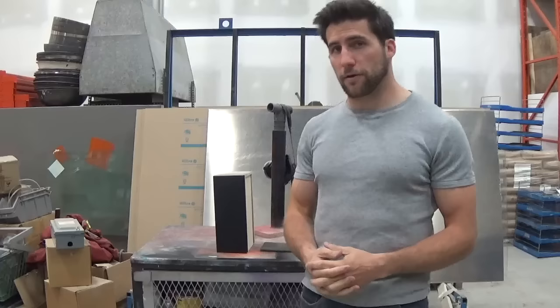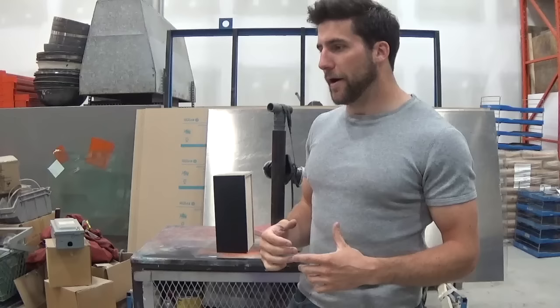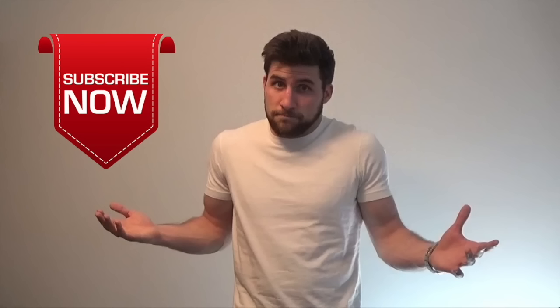That will give you that really not-shiny-at-all look. I really don't recommend doing that — you should probably just leave it with the matte finish from the spray can — but if you're adamant you want it even duller, that's the option. I hope that cleared things up for anybody looking to do a matte finish, particularly with spray cans. If I'm doing it with polyurethanes or nitrocellulose lacquers I follow the processes in my other videos — with a polyurethane I use a matting agent, with lacquer I use a non-gloss like a 10 degree lacquer. Hope that helps, feel free to ask questions, and thanks for watching!